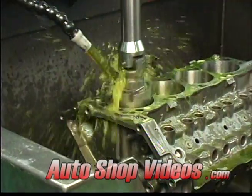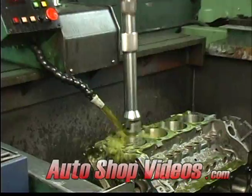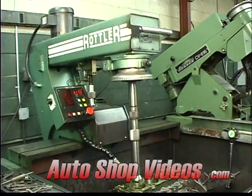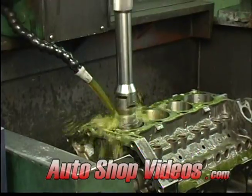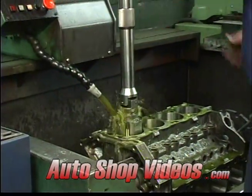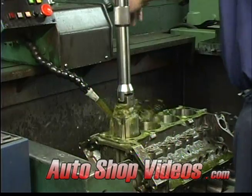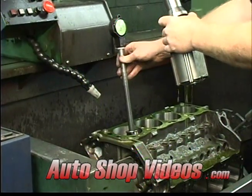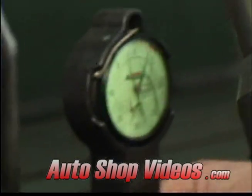Most performance rings, such as moly or iron ductile rings, tend to use a smoother finish. This finish is determined by which stones are used in the honing machine. The liquid that you see there is just coolant — it keeps the bits clean and keeps them cool. Now he checks the size to make sure he's getting to where he wants to be.